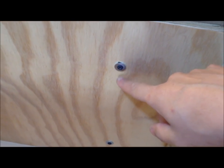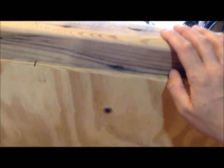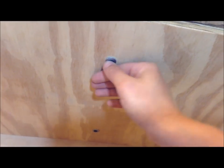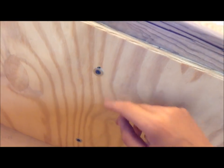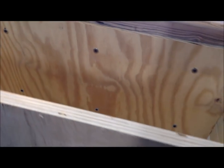To get these in there, I drilled out a little bit of the face and drilled down the edge with quarter-inch holes, elongated them, and used quarter-inch washers and one-and-five-eighths screws in those holes. I mounted them just about in the middle, which will allow them to expand and move along with the expansion and contraction of the top. Before I deliver this to the customer I'm going to back off these screws with a hand screwdriver about a quarter of a turn, because if they're too tight the purpose of those elongated holes is negated - they won't move. You want them a little loose, and this top, like most tabletops, is so heavy you don't need to anchor it super securely.